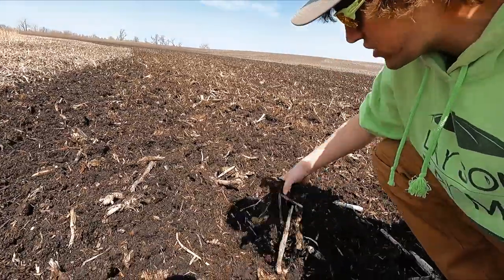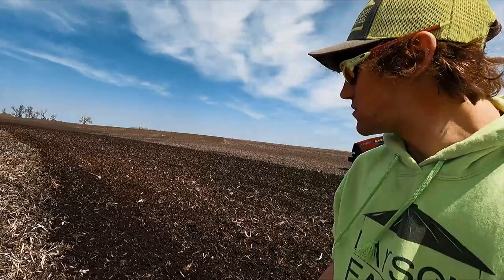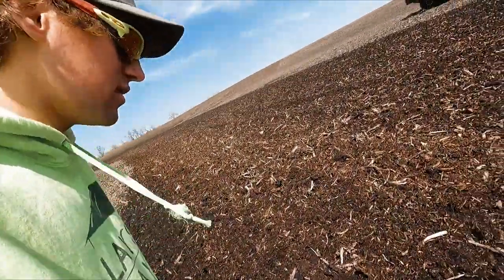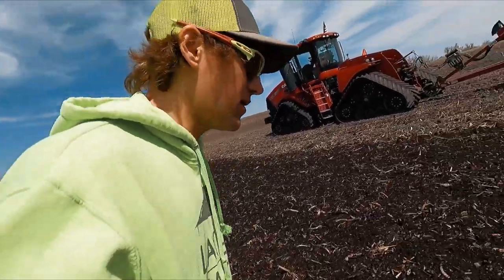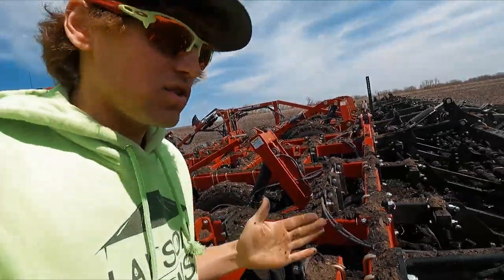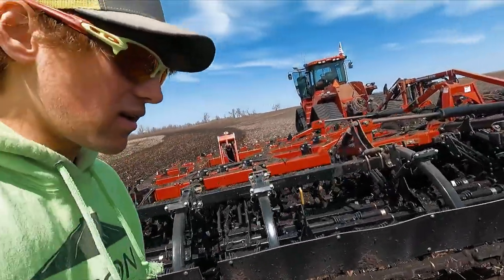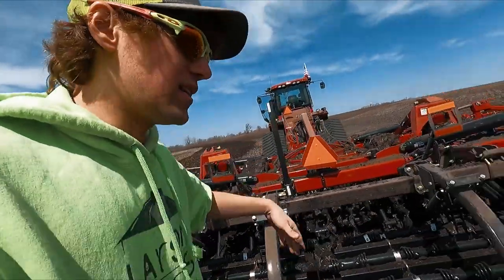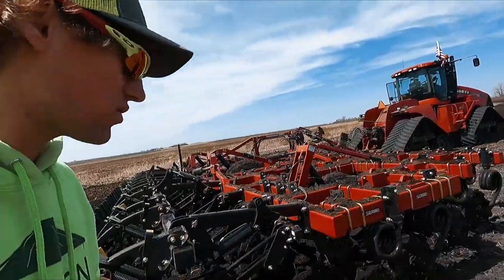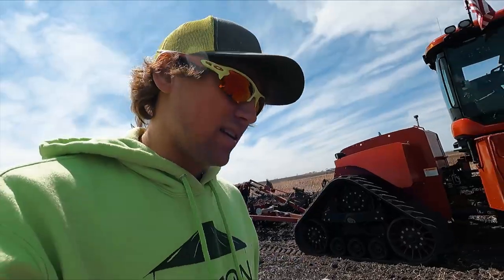Look at this — a lot of trash right here. My expectations for corn growth are limited just because it hasn't been farmed for so many years, but look at that line — the residue change is pretty impressive. And it is wet! No wonder it was pulling so hard, probably going a little deep. They said that's why they've got so much weight on the frame — all these coulters actually want to push the machine out of the ground. They said in some cases it's actually better to leave the thing on the ground and go through the wet spot than to try to tease it up like a digger, because you just shove your landing gear into the ground and make big black muddy streaks. It's best if you can pull it through there, just let them roll. If you can't pull it through, you probably shouldn't be in that spot to begin with.